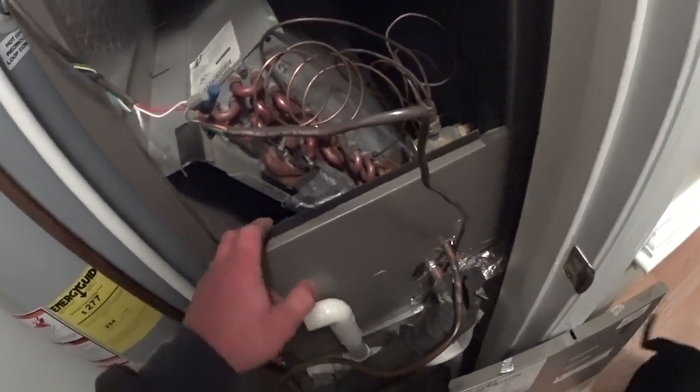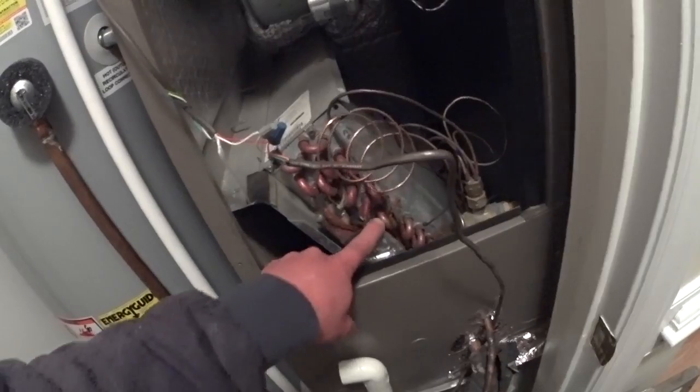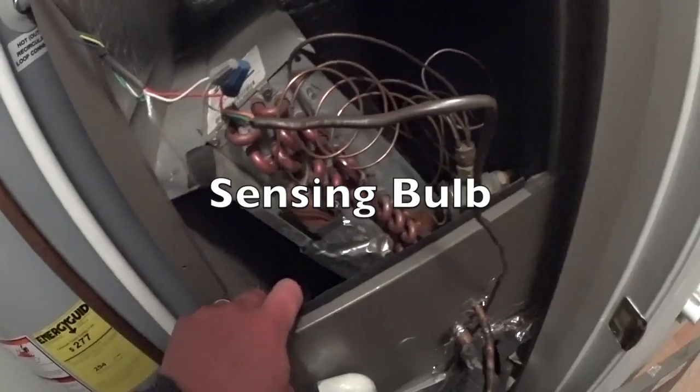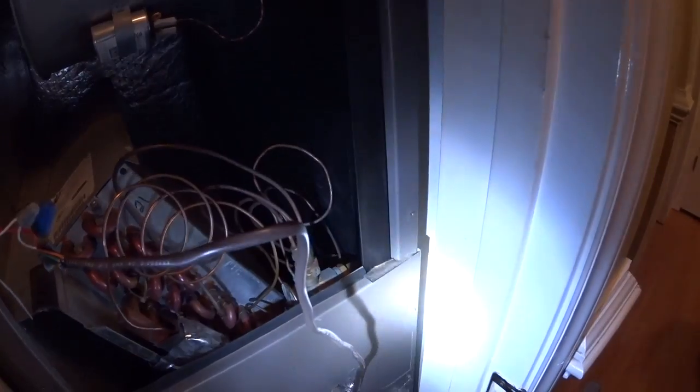We've got the condenser being recovered and I was in here trying to confirm the TXV, which we do have - it does appear to be an R-22 TXV with a little green tag on it. But look at this - that's deplorable. So I get to figure out where to put that expansion bulb. Obviously I've got great access back there - I've got screws and the door frame is here, not a hundred percent sure how I'm supposed to get to those.